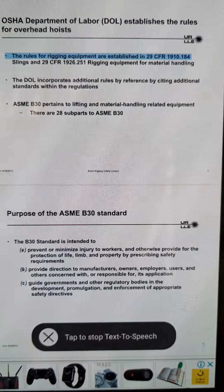Working load limits for eye bolts are based on a straight vertical lift and a straight pull. A 45 degree pull should be applied in a gradually increasing manner, with shoulder pattern only. Angular lifts will significantly lower working load limits. Sizes: 1/4 minus 20, 500, 125; 5/16 minus 18, 900, 225; 3/8 minus 16, 1400, 350.